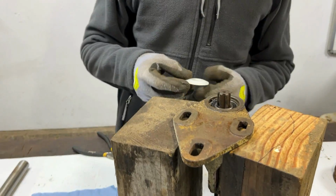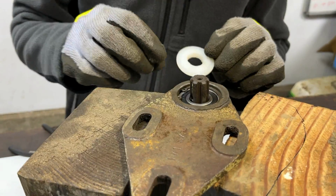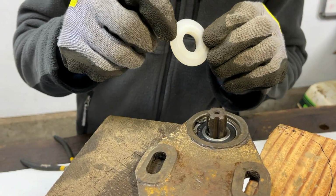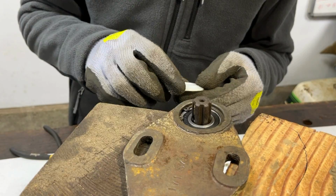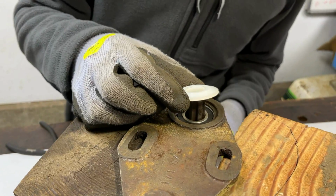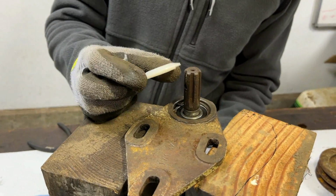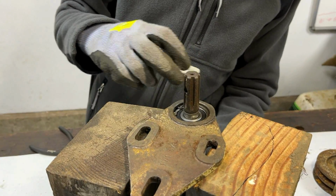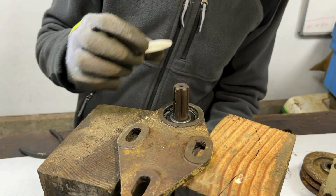We've decided to put on the nylon seal washer first. So what we will do is probably just slot this on the end, and looking at this you can see why you had to have that kind of step on the back because of the internal circlip. But we will push this onto here, and then we need to find something to put under this to hold it at the right height so that we can then put the snap ring on. So we will find something to put under there and come back to you in just a second.